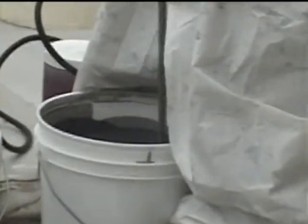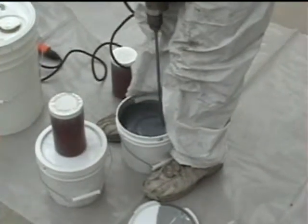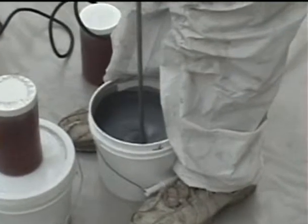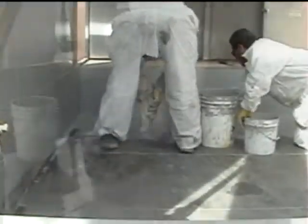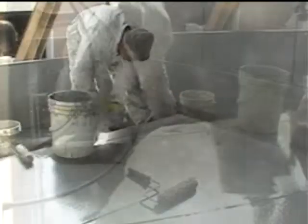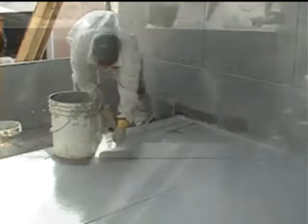Tower Seal is a solvent-free, 100% solid, pre-measured epoxy formula which ensures a perfect mixture on each and every project. Tower Seal is applied by brush, roller and airless sprayer. Each surface will receive two complete coats, ensuring thorough coverage to all metal surface areas.